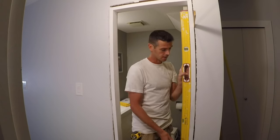This door is ready for casing — and casing a door that you have to hang this weird is a whole other video. Got the handle installed. Let's make sure everything closes pretty easily. The reveal is great — nice and solid there, looking good down there. Door's not racked or twisted. It's staying where we leave it — not opening or closing on its own. Put it all the way this way, it's not closing at us. Put it all the way the other way, it's not opening at us. So it's good.